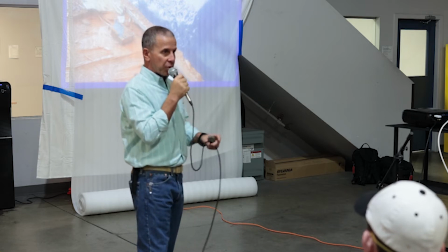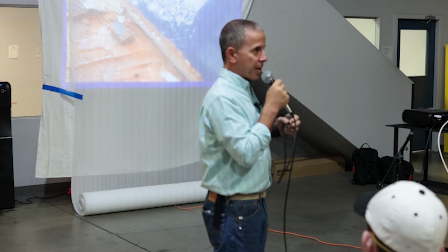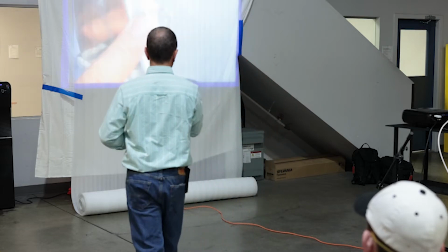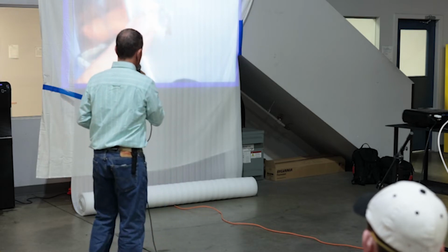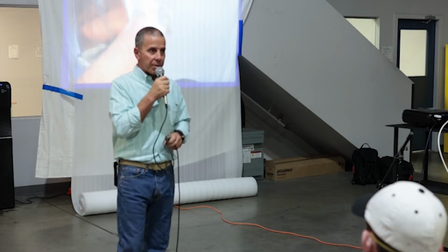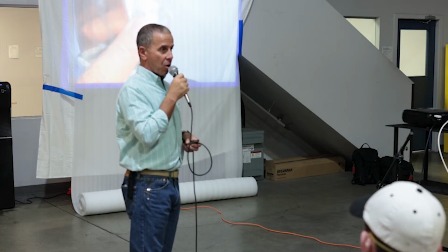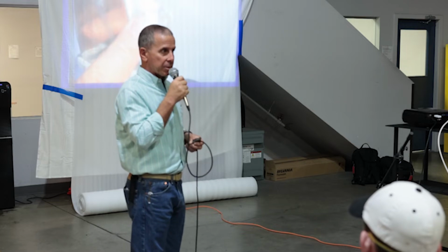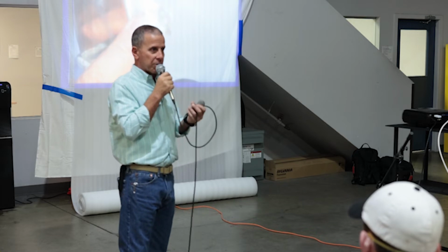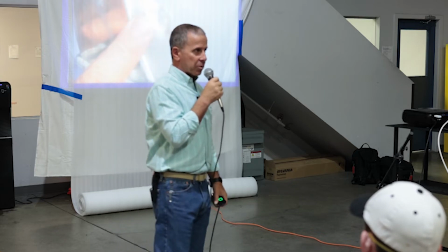So it's not only breaches in the paint that are caused by scratches or drilling or cutting, but it's water that is being held up against those painted surfaces as well that can lead to this corrosion scenario. And here's an example of a blister that is created by water that has penetrated beneath the polyurethane paint and caused the aluminum to become reactive. We're getting this poultice corrosion scenario, creating what's called aluminum hydroxide, which is the wet version of that white powder that you see develop on exposed aluminum surfaces.